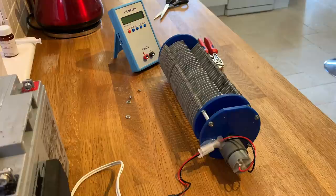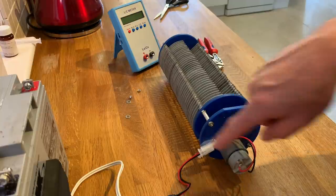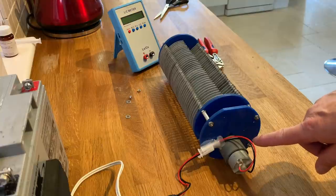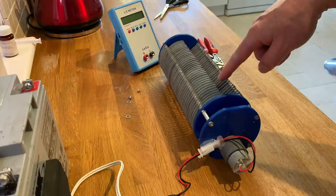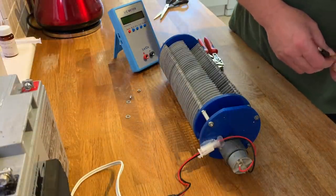This is a capacitor that was donated to me by Andy, M0JLY, to which I thank him very much indeed. This is for the magnetic loop project I'm playing with at the moment. It's quite a large capacitor and I'm going to test the range now. It came with a motor drive — I've just added a socket, plug and cable to a battery. It winds at three revolutions a minute, which means it turns incredibly slowly because of an internal gearing of about a 10 to 1 ratio.